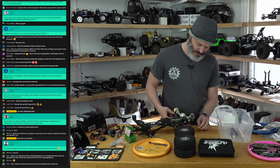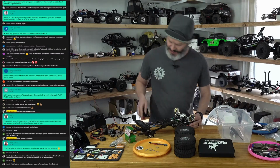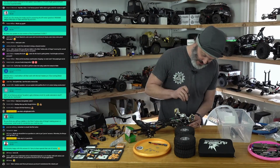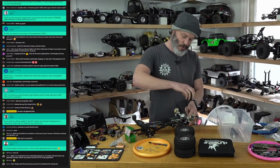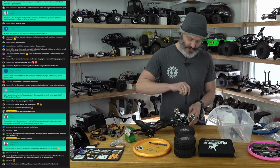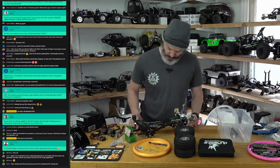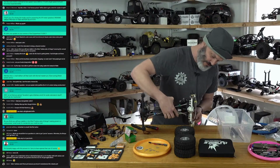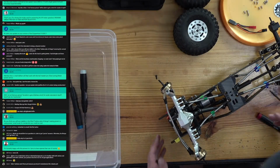Still, you were asking about KV. How do the winds determine the KV? It's all about back EMF though, and that's why some motors may be a 1 turn for a certain KV, and other motors may be a 5 turn for the same KV. And you do have to keep within a golden zone for motor design if you want any sort of KV out of it, essentially. Because if you go way too fast, technically way too slow, you can get away with.